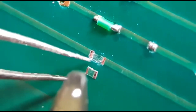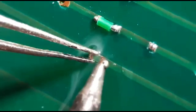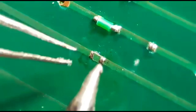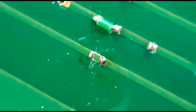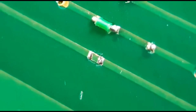I've got my little bit of track already prepared with a little bit of flux. You just lay it in there — I've already got a bit of solder on the iron — and literally just tack one end to get a little bridge, then do the same at the other end. You've actually got a nice little bit of track grafted in there, exactly the same. This is quite a hard option, but you can go over the joints with a little bit of tack-pack glue or conformal coating to protect them from shorts. It matches the track size perfectly, and if you've practised the other three you could get to do this one. That's option number four.